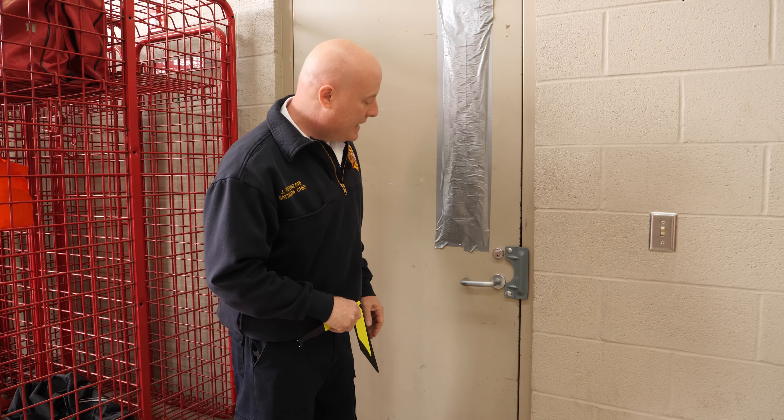One of the other tools we have is the firefighter swipe tool. It comes in a little tube — pull it out and unroll it. It essentially works the same way as the shove knife or Shrum tool. The big difference is that this is used on an inward-swinging door instead of an outward one. The same problems apply if we have a deadlatch plunger; in this case there's no way to see it because of the jamb configuration, so it's always worth a shot. We pull the tool out, put it around the edge of the door between the door and the frame, and bring the tool down at a 45-degree angle in a slow, steady motion, using the edge of the tool to move the bevel of the latch and open the door.